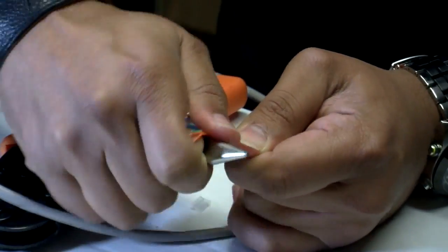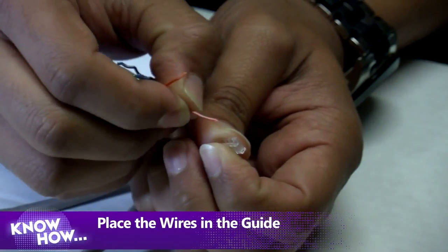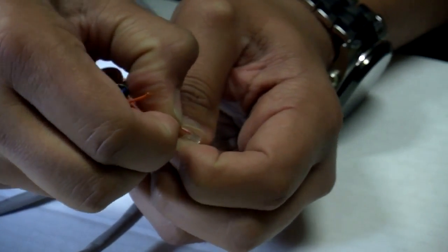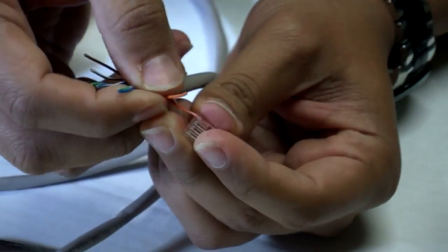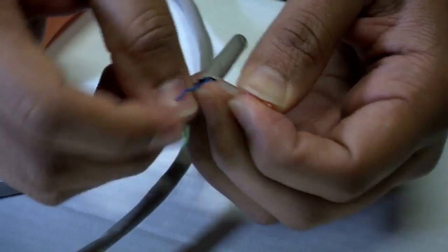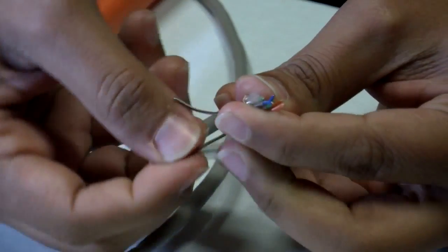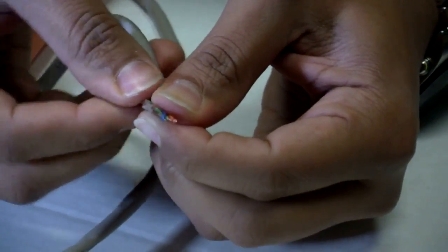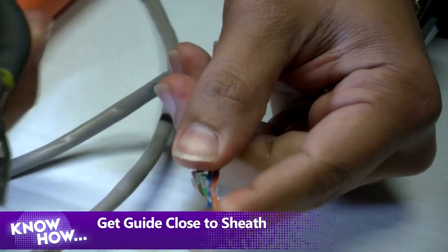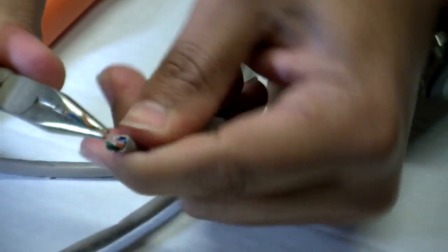The guide is tiny — it helps you put the cables right into the RJ45 connector. I like to straighten out the cables using a screwdriver or needle-nose pliers to straighten out any kinks, which makes it easier to thread them through the guide. Thread the wires through: white-orange, orange, then green-white, blue, blue-white, green, brown-white, brown. These are so tiny it's hard to see — just trust your fingers. If it gets stuck it just means the end is frayed, just keep going.